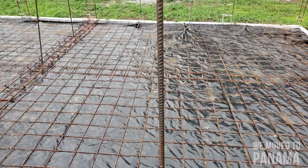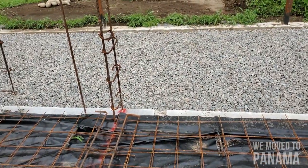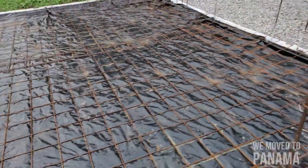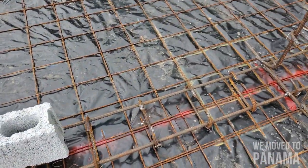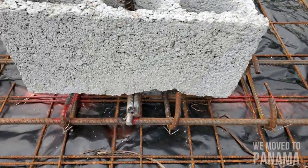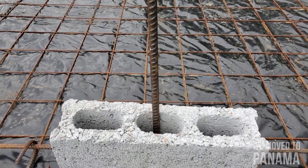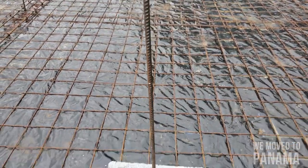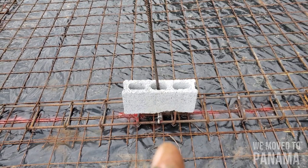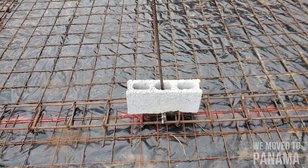Made them earlier. Let's go see between the walls — all of them, wherever there's a wall, every meter there will be one, and at the end of each doorway. Here's your block, here's the bar coming out of the foundation — the outside walls and inside walls will also come out like this because it's a floating slab, coming basically out of the foundation as well. I'll weld it on there — that's where it will sit. I had to pace it out carefully to make sure that bar I put there every metre sits correctly. Some of them I had to shift a little bit to make sure the block will go in that position.